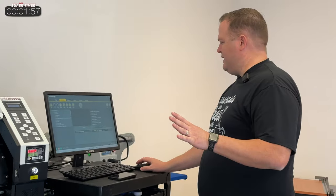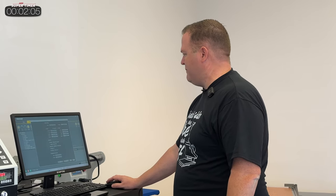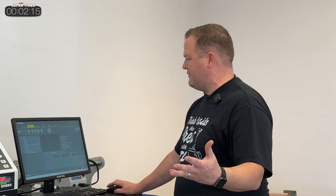One thing people don't realize is you can actually set up a certain number of copies in Print EXP. So we know we've got about 15 of them. I'm going to right-click and go to task settings and set it to five copies to start with. Basically what this does is when it's done printing, it's going to start printing the next one automatically, so I don't have to manually keep coming back and restarting it.